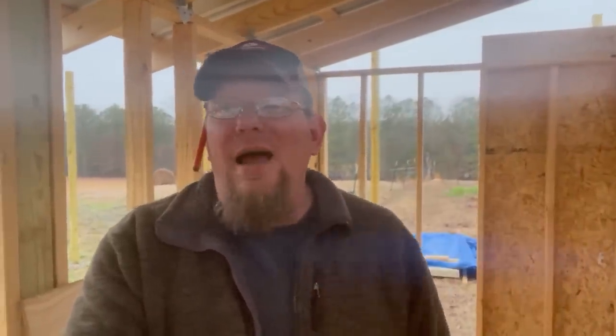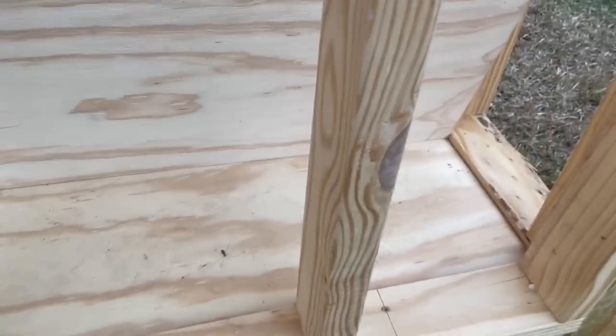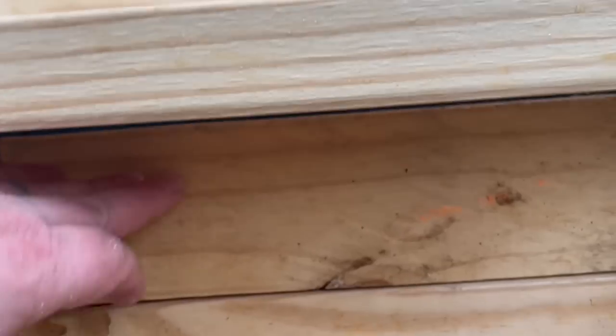Sis is making dinner, Frankie's making hot chocolate — it'll be all right. One more problem with the way I did this floor by putting the walls on top of the joists: at the edge of my flooring I've got nothing to nail to in between the wrap and the joist. So what I'm having to do is come along underneath and add a board all the way down on every one of those so I've got something to nail to along the edges of my floor. I guess there's a reason they build stuff the way they build it.